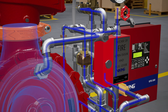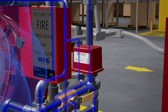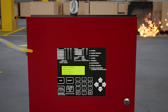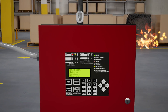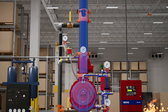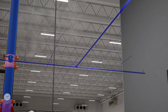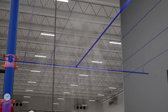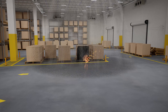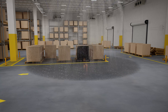The PORV is activated when water from the outlet chamber forces the pushrod open, redirecting prime water out into the drain cup. Simultaneously, water will also fill the trim leading to the water flow alarm, causing it to activate and alert the VFR 500 release control panel. Water fills the system piping and is discharged through any open sprinklers controlling the fire, and the valve continues to supply water to the system until it is shut down.